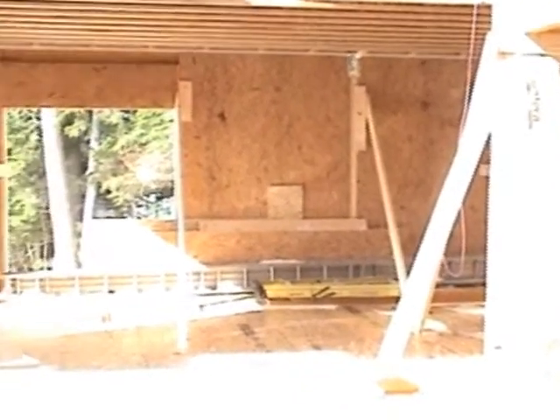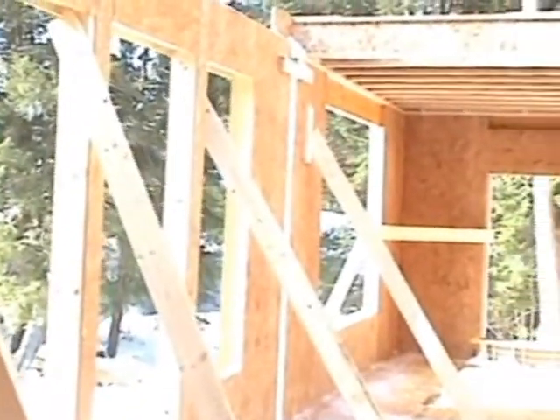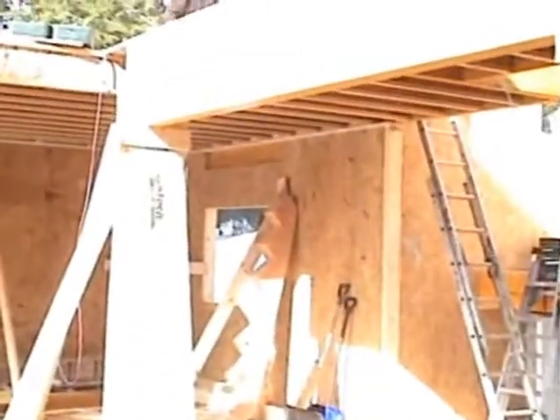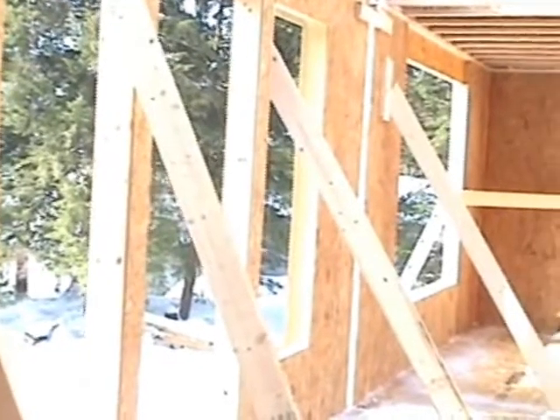Back down on the first floor, these are a more normal SIP panel height — this is actually going to be a nine-foot ceiling when we're all done. These panels are five and a half inches for the foam and then a half inch on each side for the interior and exterior skins. So your two-by-six fits nicely right inside the top and bottom for your plates and also around your doors and windows — and really that's the only lumber in this wall. These six-inch panels, because they're a closed-cell polyurethane foam, are an R-40 insulation.